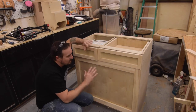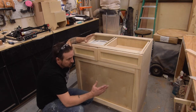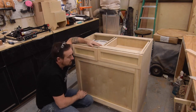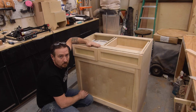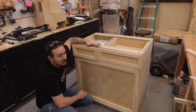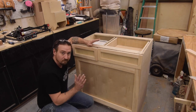As you can see, all of our trim is on. This thing has gone from basically looking like a crummy box to something that actually looks like a cabinet. I've still got to fill some pin nail holes here and do some sanding, but otherwise we're pretty much done. I'm going to put on a three quarter inch particle board top solely so that my customer has something to put their Durock or backer board on top of, since they're going to be tiling. So I'll put that on, sand everything up, and we'll be done.